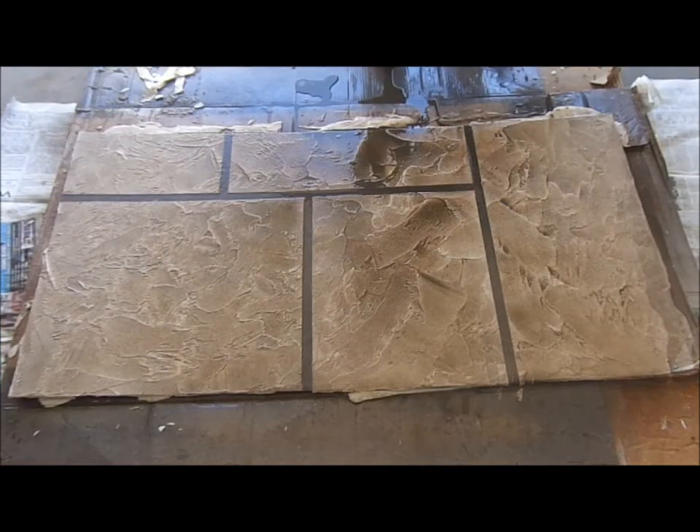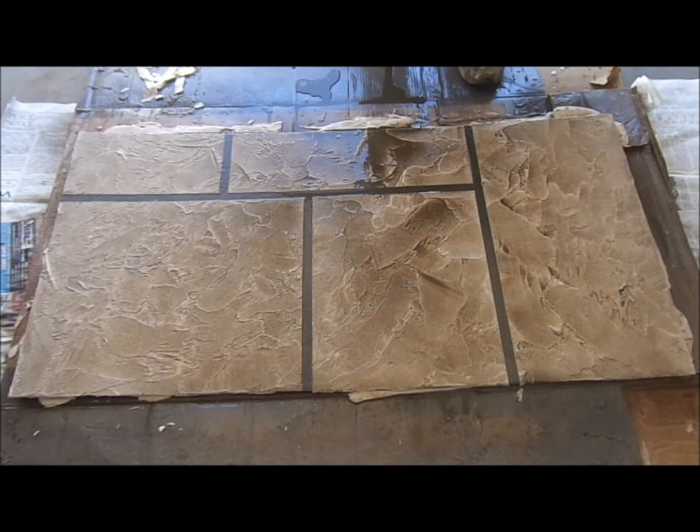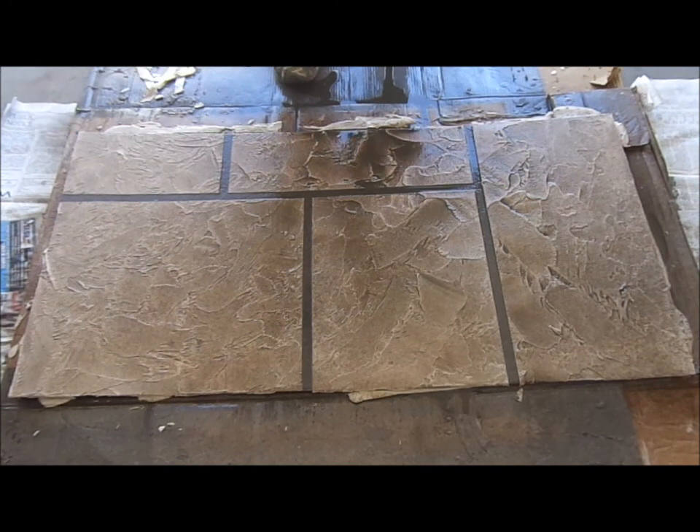I've got color fusion again — half ebony, half slate. It's a color I like to do for a little bit of antiquing, and it's always wise to spray that on wet-on-wet. It's still a little bit damp, but it's best to have two pump-up sprayers going at the same time to accomplish that. I'm just going to mist it onto the wet — it gives a little bit of an antique-y look.